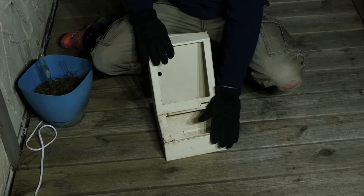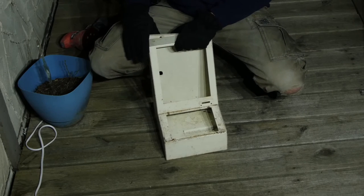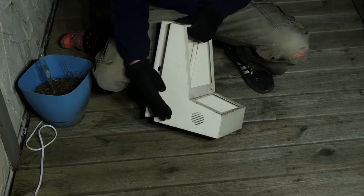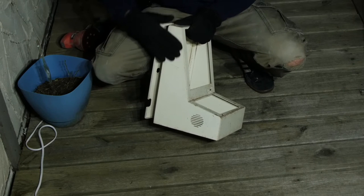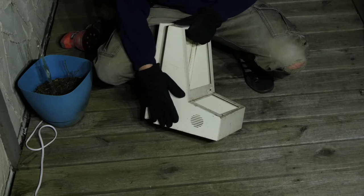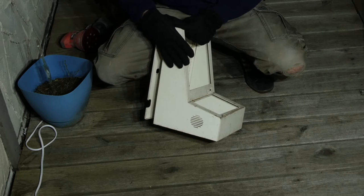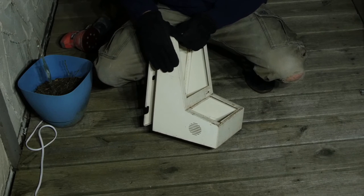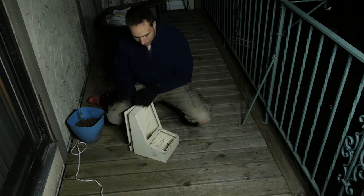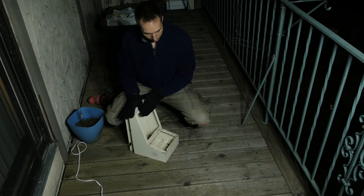This is the personality analyzer cabinet that you saw in the first part. I'm going to take my orbital sander and start with 80 grit because it's a little bit rougher. I don't think it's going to take much to take this coat off. I was going to start with 120, and I did a little test and 120 works, but it's a lot more effort, so I'm going to start with 80 grit. Let's just get the sanding all set and zip through it. I'm going to grab a different lens so that you guys can actually see this, and we'll go from there.